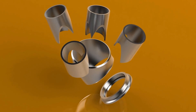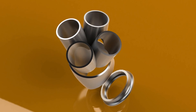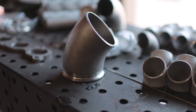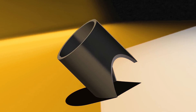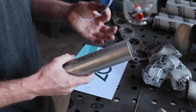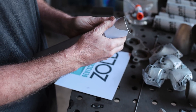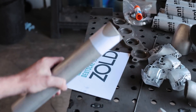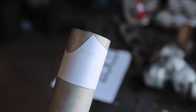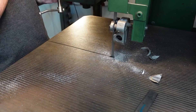This is a 3D rendering that my best friend Nick Foster spent the time to put together. It shows how each cylinder — which will have a primary made from 1.5-inch Schedule 10 pipe — will mate together and then to a 3-inch inlet for the turbo. Because Nick drew this up in CAD, the model can be unfolded and printed out on paper. I took this printout, glued it directly to the pipe so I can see exactly where the cut lines are. This should make it relatively easy to cut the pieces and have them fit together accurately from the get-go, saving fabrication time with no setup cost.